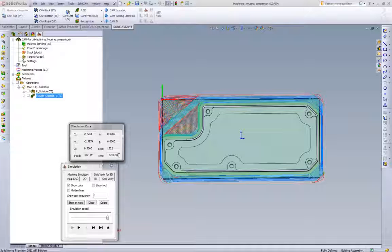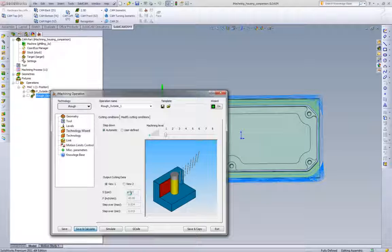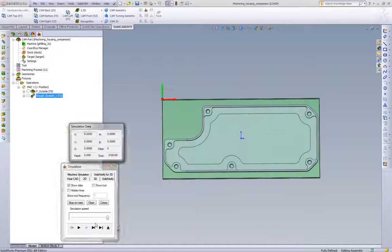We do have to remember, this is much higher than the 2,500 RPM we were running in standard pocketing, but we're limited in standard pocketing and offset strategies because of the corners. Now, even if we were to take iMachining down to, let's say, level 1, which would get us down to roughly that 2,500 RPM range, a little less. And as we say, level 1 is there to be very safe. This works really well when you have a part that's maybe hanging out in there and you really don't have a lot of cutting force, or your tool is hanging out very far.